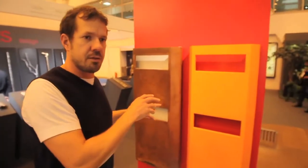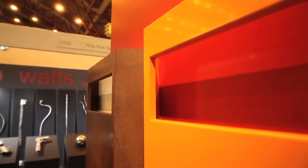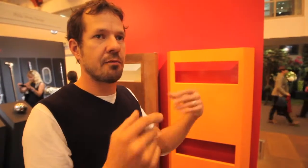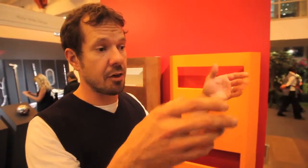Let me talk to you about the towel rails for a minute. If you look in a catalogue, it'll say it gives out a thousand watts. As soon as you hang a towel over it, it stops giving out that thousand watts. So that radiator that you've just bought for your bathroom that's supposed to heat it up no longer works — you might as well put a blanket over the thing. It might keep your towels warm, but it no longer keeps your bathroom warm. That's the problem: it doesn't work in those dual functions.